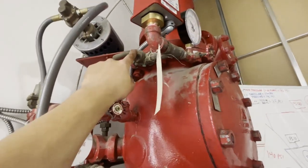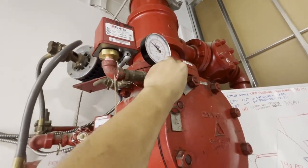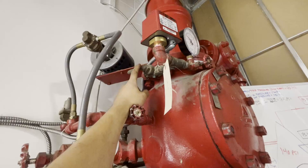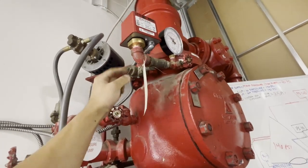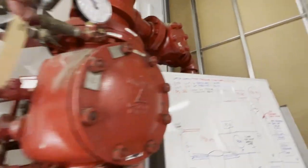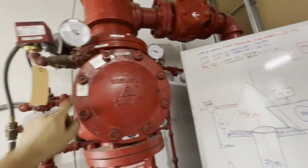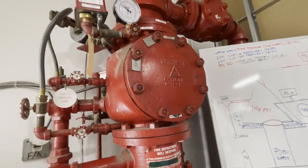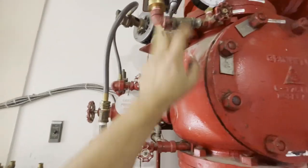There are pros and cons to installing bleeder valves. They're good because if you ever want to quickly change a switch or quickly test that low pressure switch, that's convenient. However, the reason I don't like them for inspectors is that it promotes bad habits. People are going to be more likely to just shut this valve rather than drain a system — they'll say 'the supervisory signal works,' but it doesn't prove at what pressure it actually comes in. For the sake of documentation and ensuring our signals come in at the appropriate intervals, if you just test that bleeder valve, all you've done is confirm the switch works — but you can't answer at what pressure it trips. If someone asks what pressure it goes off at, you're going to get caught out.